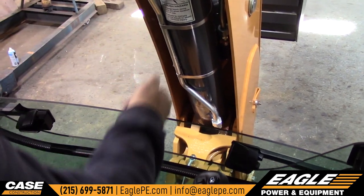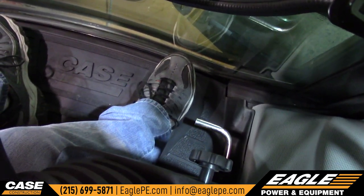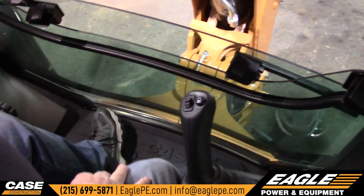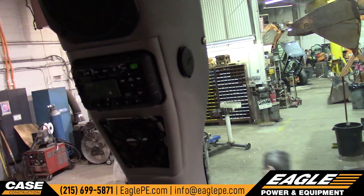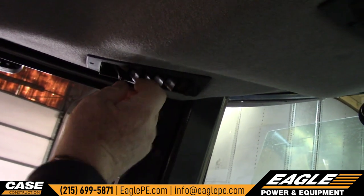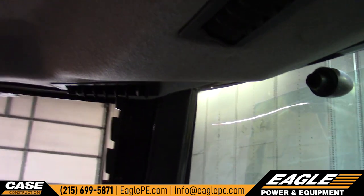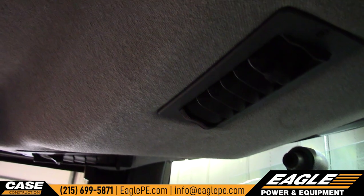The backhoe is locked — this hoe is back over center and it's locked. When you put your foot on this floor handle, that will unlock the backhoe when you bring the boom back to you a little bit. These two ports over here are for your phone. The machine is set up for radio already — speakers are installed — and you can set it up for XM if you want. These vents are all adjustable. In the summertime you want to adjust these to blow on you; the ones up front at the windshield you close in the summertime because you don't need the air conditioner blowing on the glass. In the wintertime, you close the ones that blow on you because you want to heat the glass.